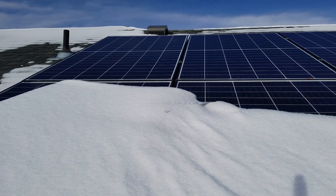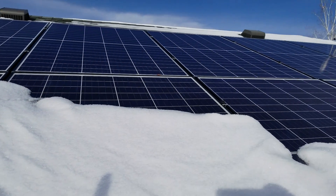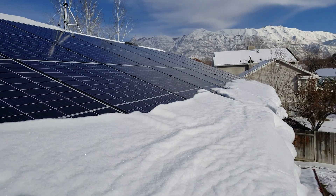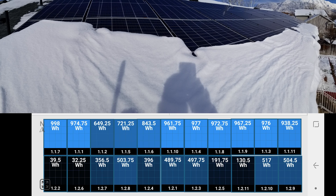That winter I quickly discovered that the snow will slide off of the panels as they warm up. Then the snow will just start piling up on the edge of the roof, and the gutter acts as a catch where the snow falls in and just backs up on the panels. Here in this video you can see that very thing has happened — the snow slid down the panels and hit the edge of the roof and the gutter and just started backing up from there.